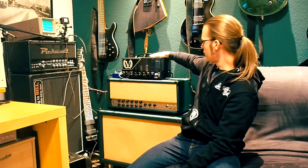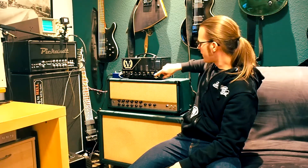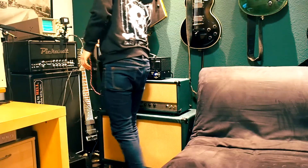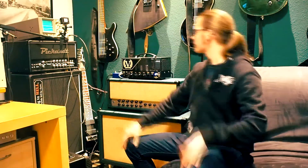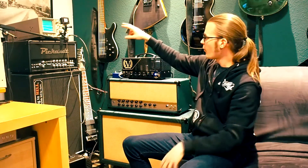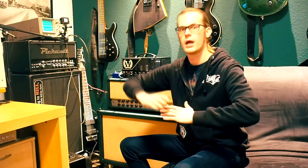The sine wave goes from the computer into the V30, and I'm in the high power mode now. I'm going out on the 100-watt 15-ohm resistor — I don't have 16 ohms but it's close enough. I'm watching the output directly on the resistor on oscilloscope channel 2. Channel 1 is for the input signal going into the effects loop return, so I can verify the input is clean going into the valve amp.